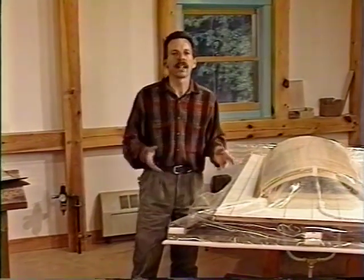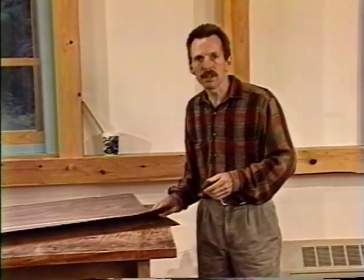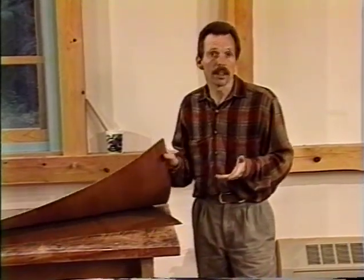While this is curing, let's talk more about Two-Plies and why I chose not to put the face veneer on in this layup. Now, a Two-Ply is exactly that. Two pieces of veneer glued together with their grain going 90 degrees to each other. This is really a very thin sheet of plywood. The advantage of Two-Ply in curve work is threefold.